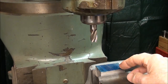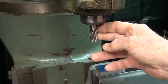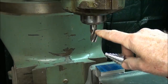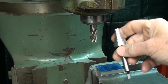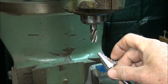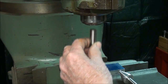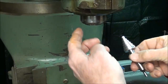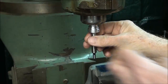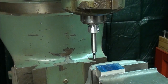There will be many times on your Bridgeport Mill when you need to change tooling, and then stop, possibly take the tool out and put your wiggler or your edge finder in there. Quite often, the collet size that you're using for the tool is different than the collet size you'll need for your edge finder. So the purpose of this is to have various steps for your common collet sizes that will allow you to quickly remove whatever tool you had, and without changing the collet, quickly put the widget in, tighten the collet, and it's ready to go.